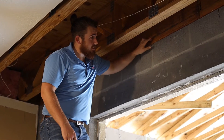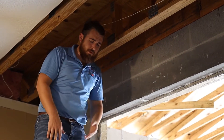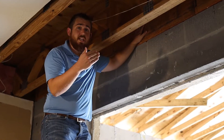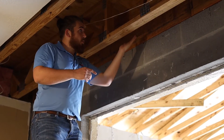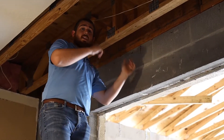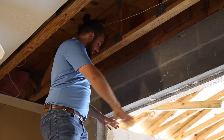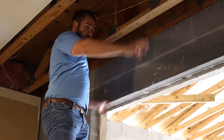We have to put a beam up in here. It's a three-ply beam, which is what the engineer called for. We've got two of the beams in there already. A three-ply beam is where you take three one-and-three-quarter inch LVLs and sandwich and nail them together. We need to get a third one in, but we're flushed — there's no more room. So we have to take the floor joist off of the outside wall, push these in, and then slide the third one in. That will allow us to support our second story, supported down on the post footings that we poured underneath during the original pour.